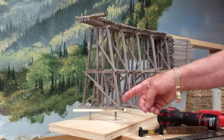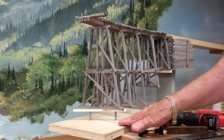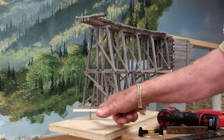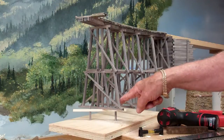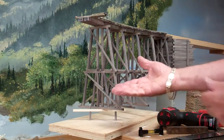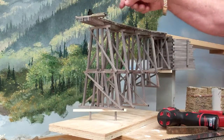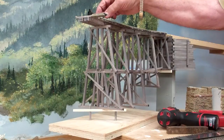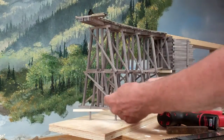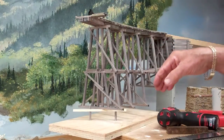In the case of the tallest bent, there's not a lot of room. I want to get these pilings as close to it as possible, so I've used the same block with a couple of pilings pressed through — these are a press fit — and adjusted them by pressing down to raise it up. I've put a level on top of the track here, because the track at the other end is coming in and I want this to be level. I've adjusted these by pressing them up or down until the bubble is in the exact spot as on the opposite end.